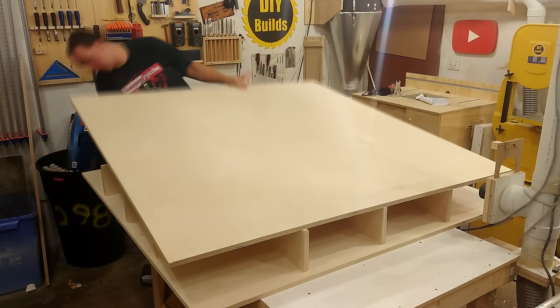I couldn't really find any good affordable pulleys for guiding the belt, so I made a little jig with a hole saw to press down on the outside of a fender washer. This is a half-inch fender washer so it will fit on the half-inch bolt, and its little bent profile will allow the belt to guide itself onto the bearings in between. There's no room to jam nut it, but I'm using a half-inch nylock nut so it should never come off.